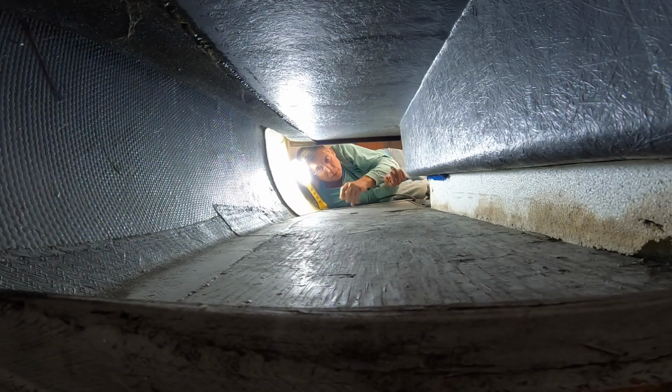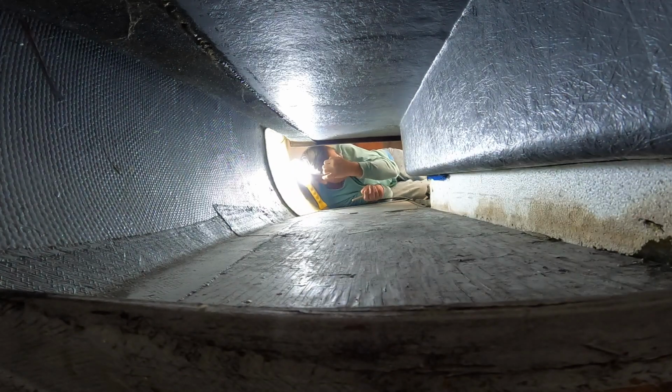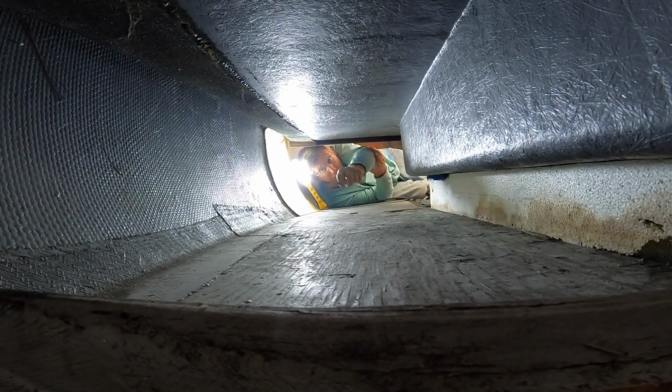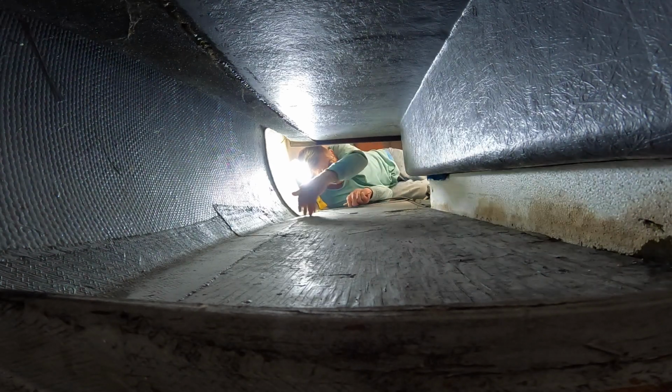I'm going to set my saw at a 55-degree bevel, which is as steep as I can go. And I'm going to just run it right down this side right here and cut it as far as I can cut it with a skill saw. And then I'll use an oscillating saw to finish cutting the very tip end out there, and to square out my corner here. And I'll cut what I can right here with the skill saw, and then I'll finish that with the oscillating saw in the corners there as well. And then that should pop up.